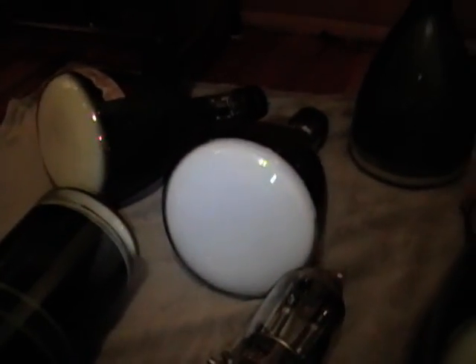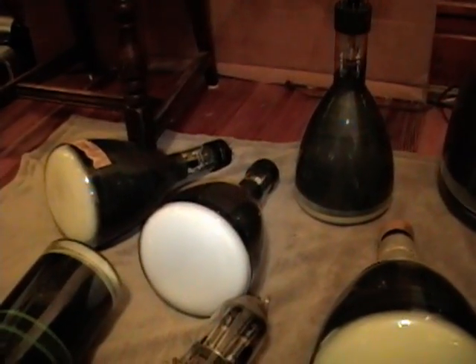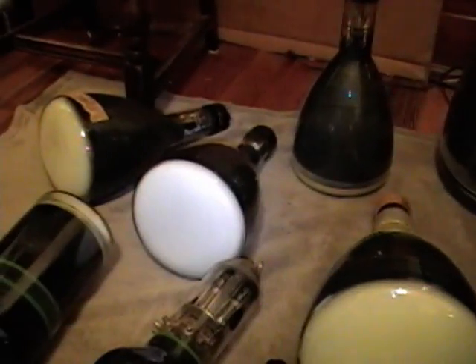These are some picture tubes. These are 7JP4s, commonly used in sets like this, except for this one - this is a 7VP1, which is the green-white or green and black tube used by RCA. They actually made a seven-inch oscilloscope. The nice thing is it's fully compatible electrically with that set, and it's more common and less valuable than these 7JP4s, which are getting kind of scarce. So when I test out sets, I always use that tube first so I don't damage one of these harder-to-get tubes.